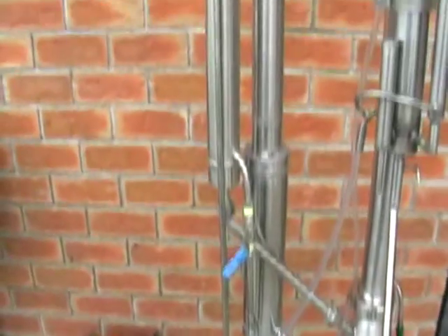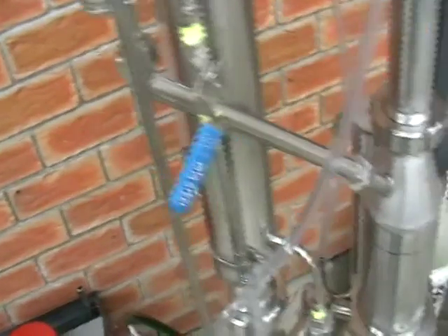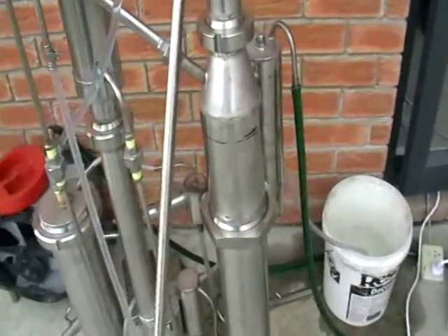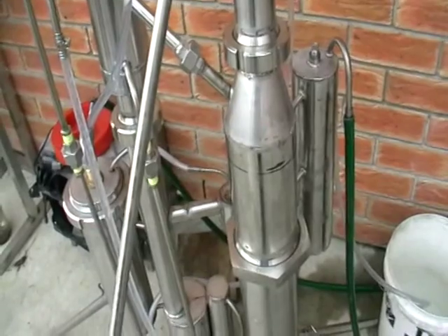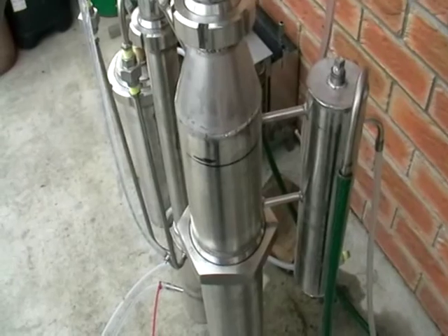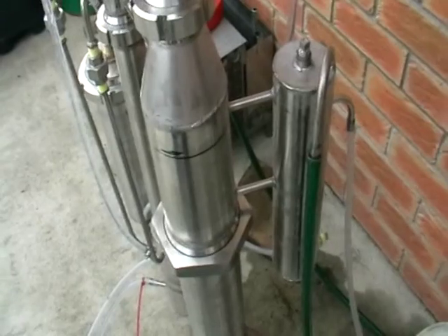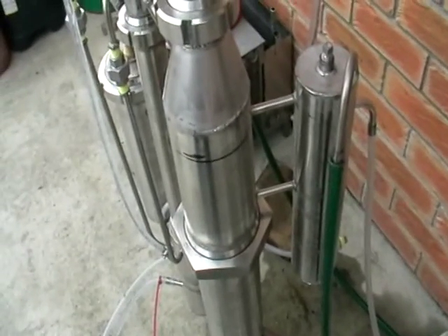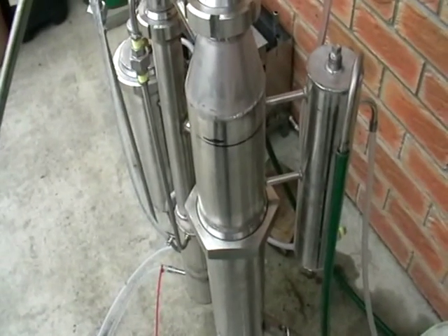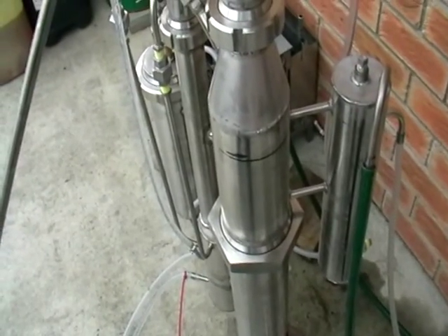Here's a heat exchanger. From the heat exchanger it's connected with a separator — an actual separator. And this separator is connected with a water trap. The water trap reduces water continuously. It's like good water — you can reuse it for cooling or whatever, just water. So this water is recovered from the steam, and water is removed from the ethanol.